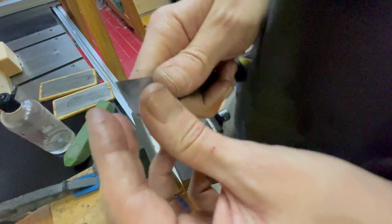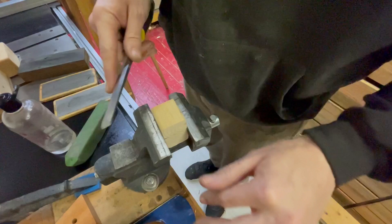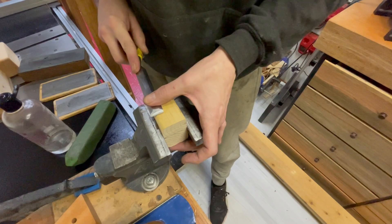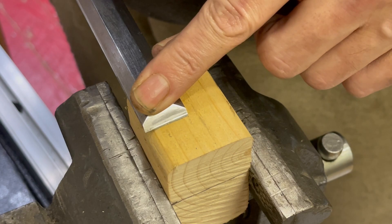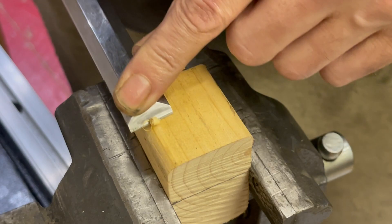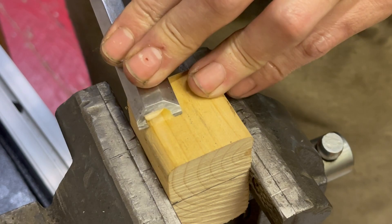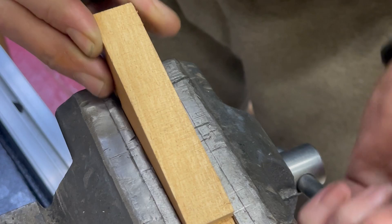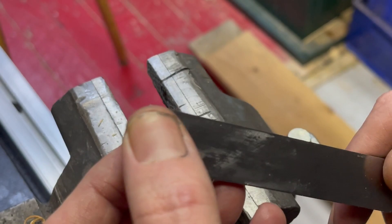You also look at it and I've still got a little burr on it. I'll put a bit of wood down and show you. I just keep it flat and raise it ever so slightly - don't push any weight into it. Just put it onto the flat and lift it up ever so slightly, leaving a bow here and push it across. If it does that, then that's sharp enough for most work when it comes to woodworking. A couple of minutes' work with the right method and technique and you can get your chisel sharp.